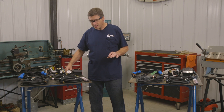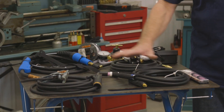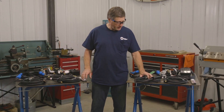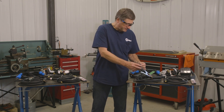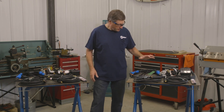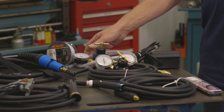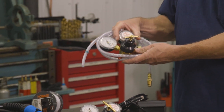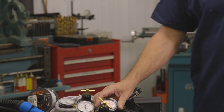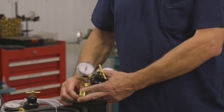As far as the pieces that come with the machine, the accessories are largely the same. You get the same TIG torch, the same ground cable and stick stinger, and the cables are the same size as well. You get the same MDX 100 MIG gun in both units. With the Multimatic 215 you get a standard regulator in the box, but when you order the TIG accessory package you get a slightly different regulator for the TIG setup that has two fittings on both ends.